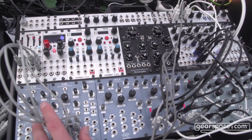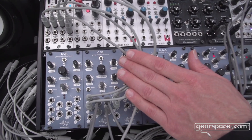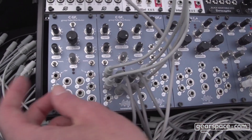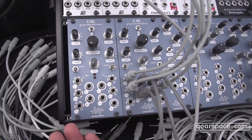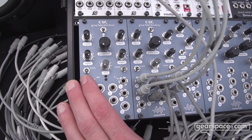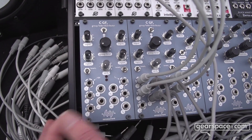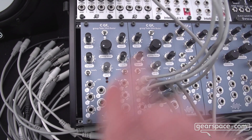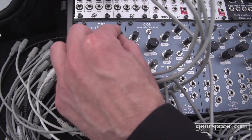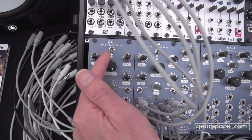Three modules are new. There's a Group Fader and Distributor, which is a macro controller. There are four channels possible with inputs for CV or audio signals, or in the absence of any input there is an internal five-volt source, so it can be used as just a manual control for up to four destinations. Or you could split out an LFO to four destinations, setting different levels for each, but then having a single convenient master control for the entire group.